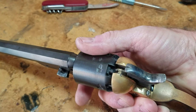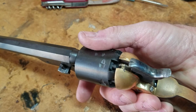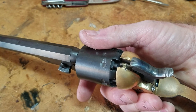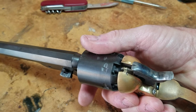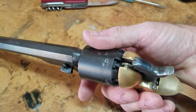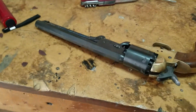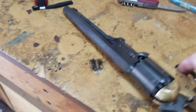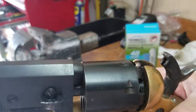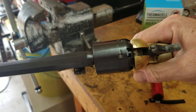So with the 3/16th hole drilled in there, I took a finishing nail, cut it off. And since it's brass, tapped it down in there with a small finishing hammer and it went in the brass pretty well. Trimmed it up, polished it, stuff like that to kind of get the action to where I needed. Let me show you what it does — it comes back and as you can see, the pin stays in line with the nipple.